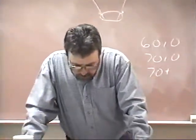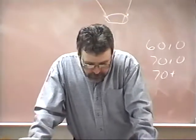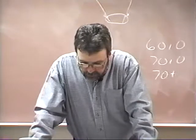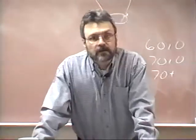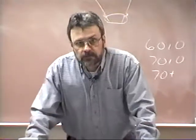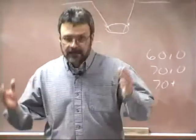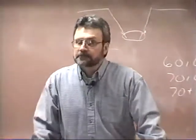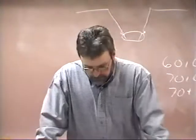The welder must be alert to recognize pinholes and then immediately take the corrective action. Obviously, if the weld has progressed too far beyond the pinholes, they cannot be eliminated by this procedure. But you may be able to pick them up with your hot pass. Remember, we talked about the hot pass correcting mistakes that occurred with the root pass. However, if you're taking a test, most inspectors will say, too bad, nice try, see you later.